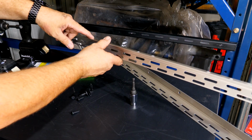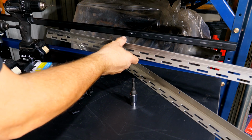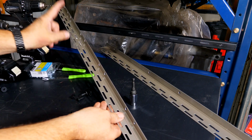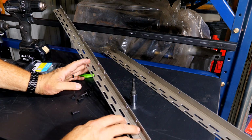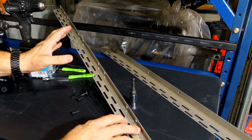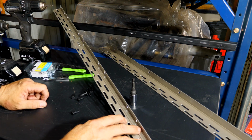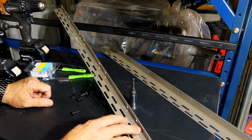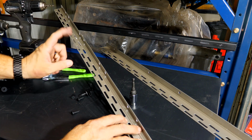And then also you want to make sure this is level, because you want that panel hanging level so that they stay true when they hang next to one another. Also, I'll mention that these rails we took down were hanging on our other wall, and these are 32-inch rails. They're 16-inch panels, but these rails are made to be as wide as the cabinet. The cabinet's 32 inches wide, so these are one-piece rails, and that gives you a lot more stability through the hanging and through the mounting of this. So that's why we had to pull these down and reinstall 16-inch ones on the other wall.